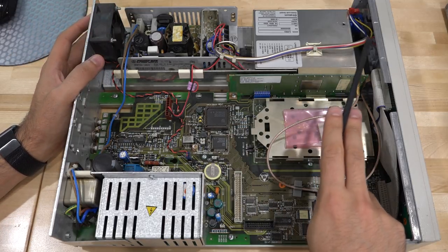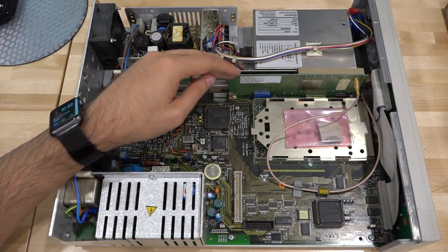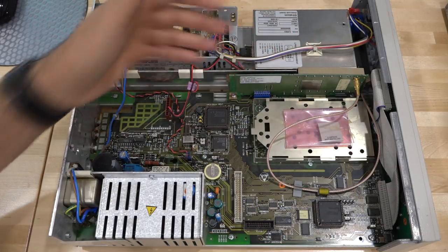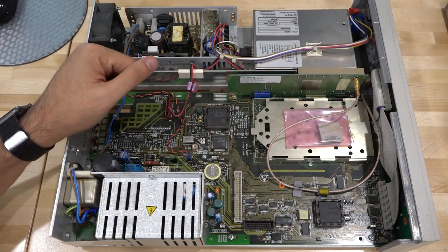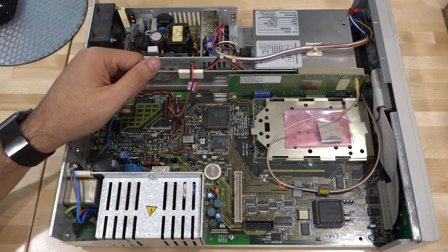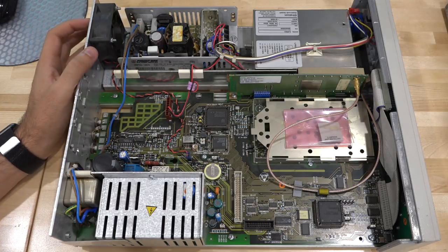This unit has the added Channel C, and I want to take the can off and see what technology it uses, since I didn't have one in the old unit. It's a divider-based one, like the one I showed before for the Agilent. Other than that, it has a very straightforward design I've talked about before, so I won't dwell on it too much.